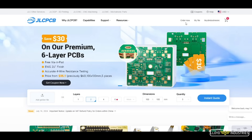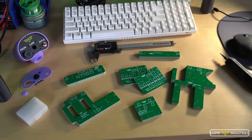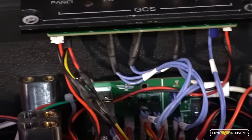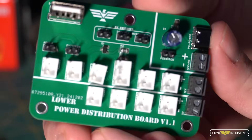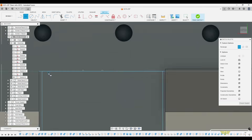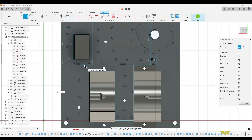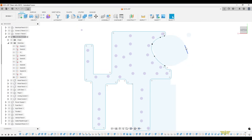With the help of JLCPCB, I was able to very quickly learn how to design and create custom PCBs for this project that made for a tidy background with minimal wires and a wicked backlighting system. The PCBs are daisy-chained in parallel to share the power for the LEDs that illuminate the lettering on the panels. All I had to do was create a sketch on Fusion 360 that wouldn't interfere with any objects and project the holes where the 3mm LEDs would fit into.